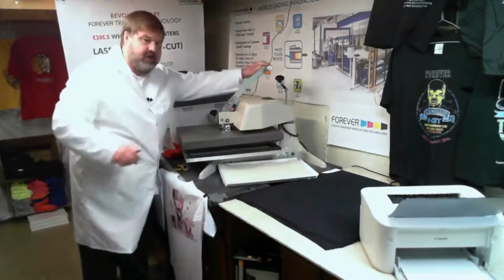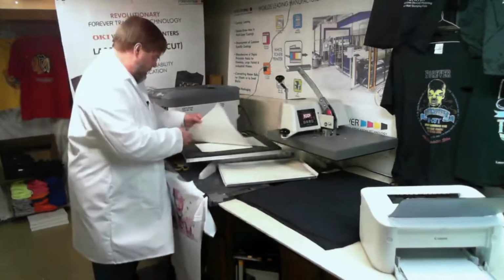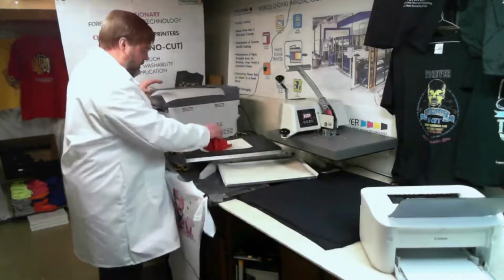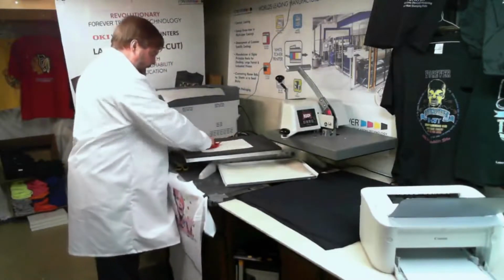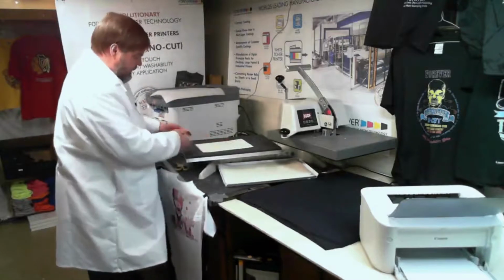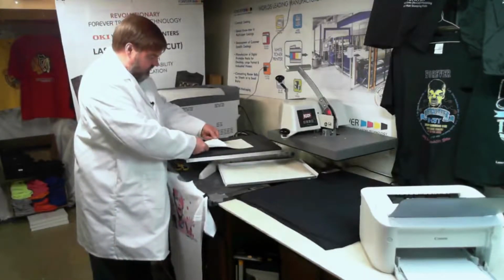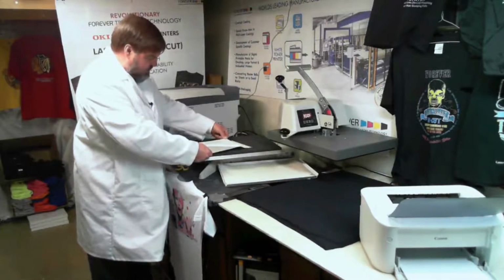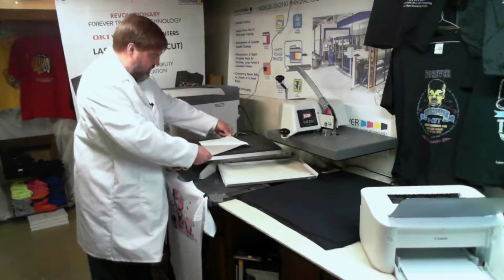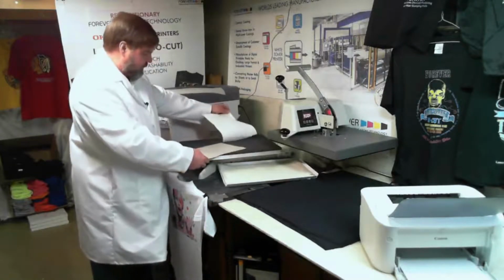Once the pressing is finished, then you need to rub the back of the sheets with a cloth with a firm motion. This helps the toner to completely settle. Then the peel is done in a firm, steady motion, keeping the A sheet flat, hot on the lower platen so it stays hot through the entire process. Firm without jerking.